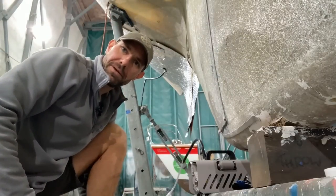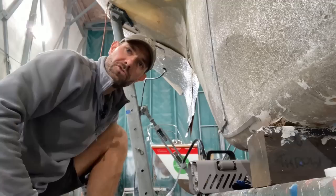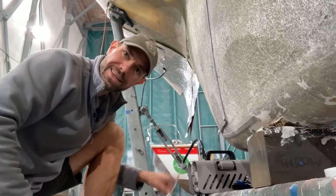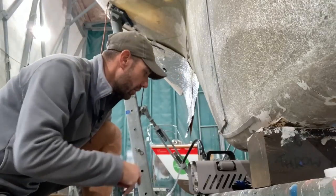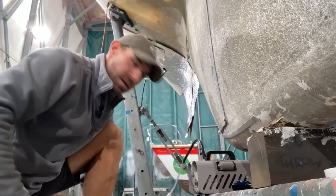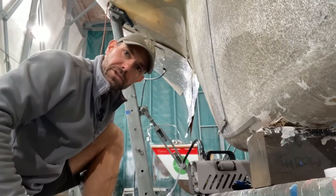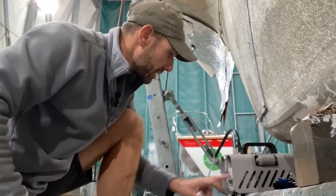So these little vac pumps that I've been using for my heating and vacuum drying rig on the hull work pretty well, but they only have a very small amount of oil in them, and when I'm still putting the pad on, it's sucking a lot of air out, and you do lose a little bit of oil out of the breather thing, the exhaust here. It collects most of it, but some of it does kind of spit out, so I do have to top it up fairly regularly. The other thing which I'm about to do now is I need to change the oil every now and again,